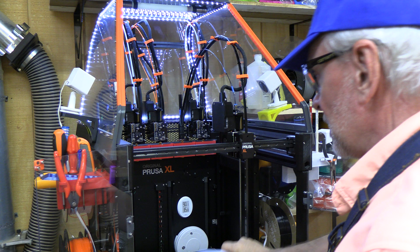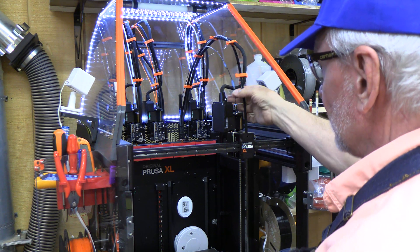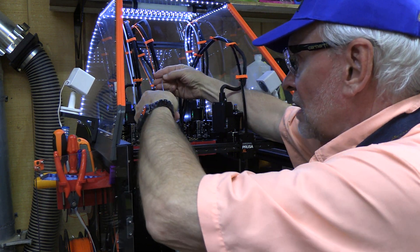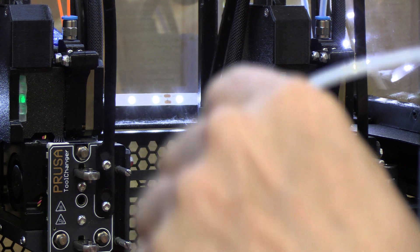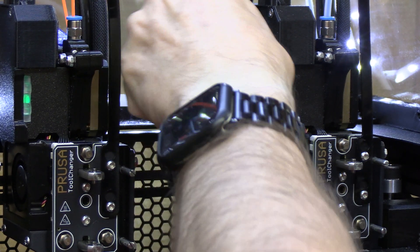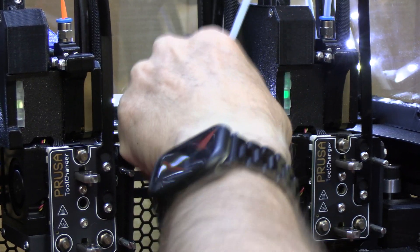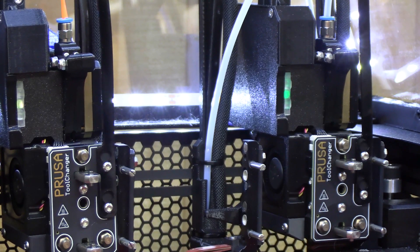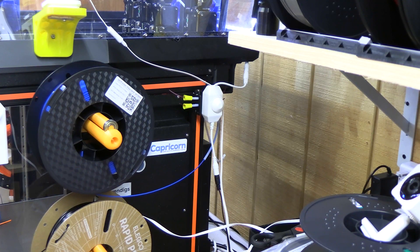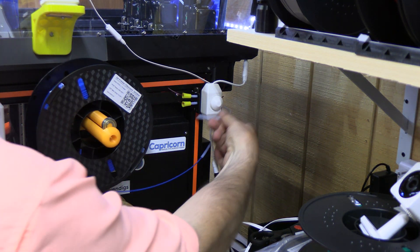The way to change to the new tubing is pretty straightforward. Unload the filament. Take your old tubing — or if you've got those little segments, which I currently do — out. Leave some filament extending from your Gore-Tex tube, and then literally push it through. Then we'll cut it to length after we determine where it needs to be on the side of the filament sensor. Here it is coming out.